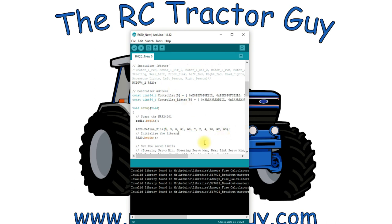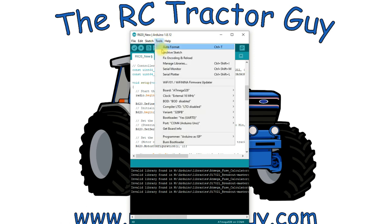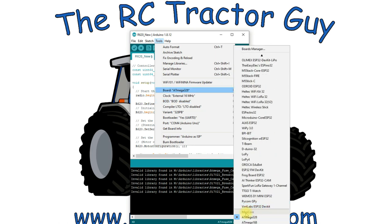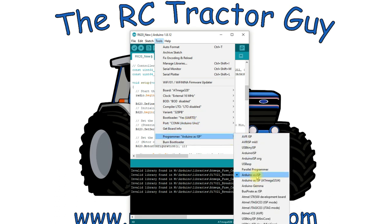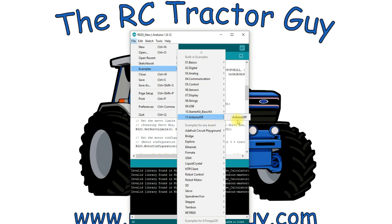We also swapped pins seven and three. Then we need to go to Tools and select the ATmega 328, using the MiniCore add-on that gives us all the options. We can choose the clock frequency — external 16 MHz — disable the brown-out detect, choose the 328PB, and select our programmer as Arduino as ISP. To set up an Arduino for this, you plug your UNO in and use the Arduino ISP example sketch.